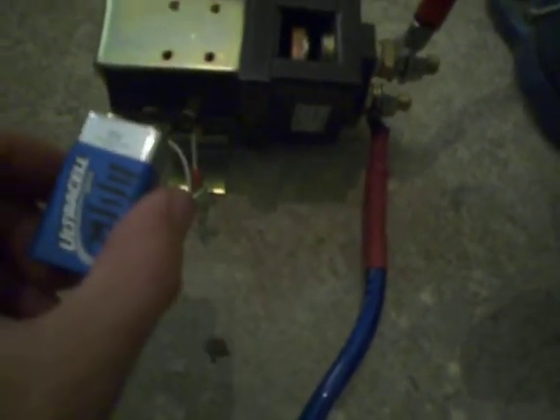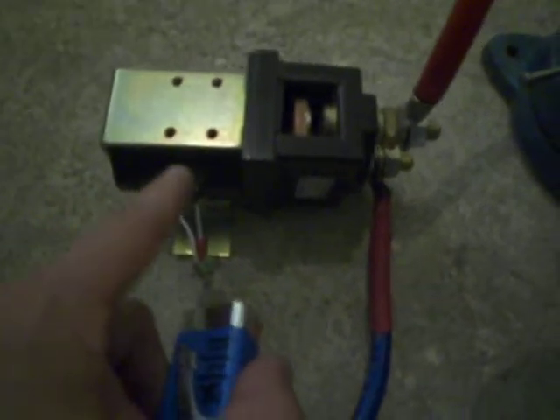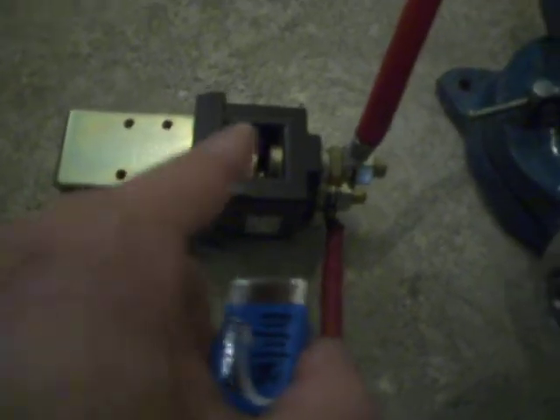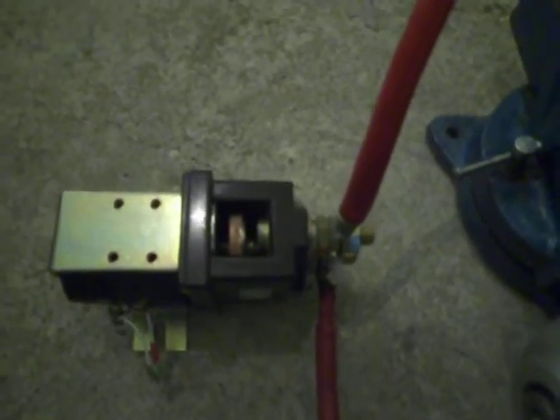Let's give a demonstration on how this works. What I'm going to do is turn my battery source on, and I'm going to use this 9 volt battery to energize the solenoid here, and that solenoid will cause that piece of copper to move up against those terminals, and then you'll see the motor turns.